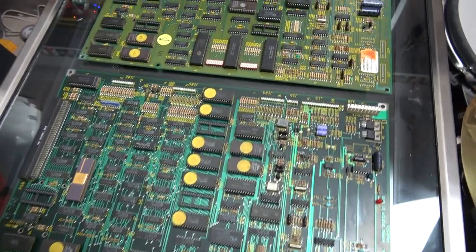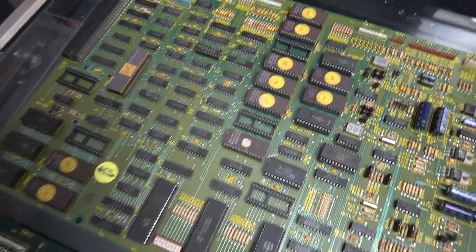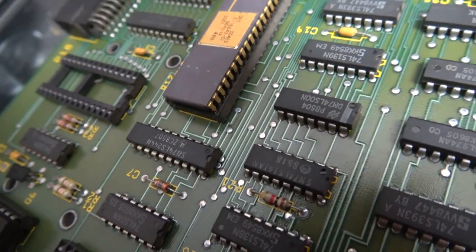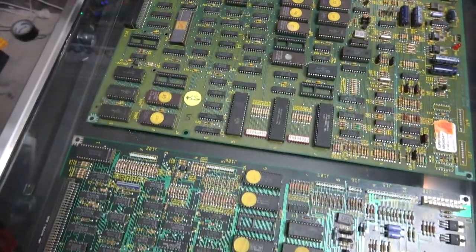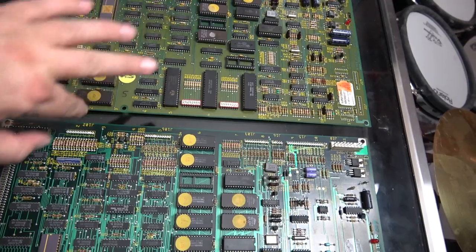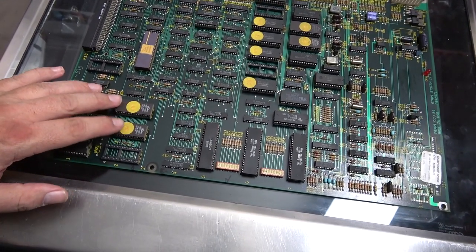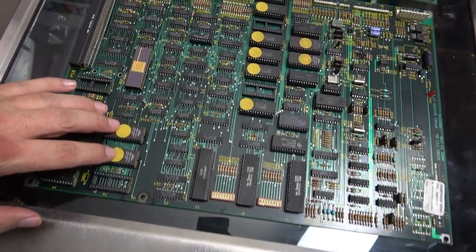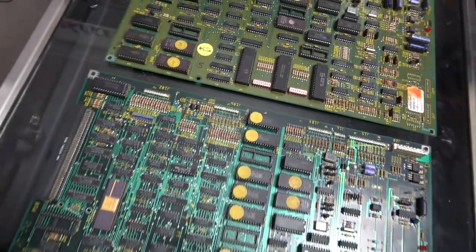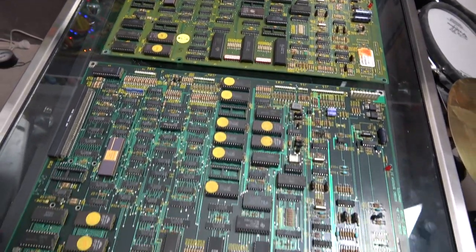Comparing the two boards, everything's the same, but there are a few curious things. That incorrect processor was even half up out of its socket. One thing that's curious is that two chips which seem to be game ROMs may need swapping — on Championship Sprint they're laid out differently. I'm not sure if that was a mistake, and I can't trust anything on that board, but I may need to check that out.